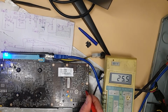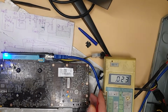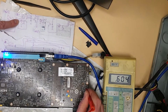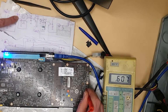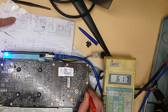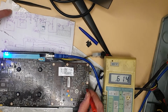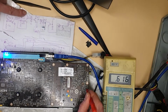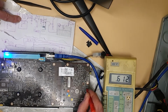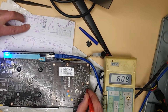So if we got a positive voltage here and sense here, we should have this transistor open, and it should be very low here. It should be like 0.05, 0.1, a low current, you know, the transistor is saturated, but it got 0.6, as you can see. That's too high. There's no way there is a current flowing to the ground. So that current is basically coming from here. Here we got a divider from 3.3 volts, and there we have 0.9, and we got 0.1.